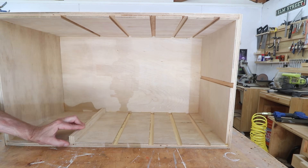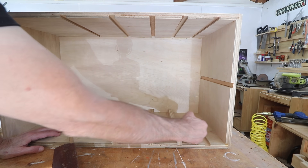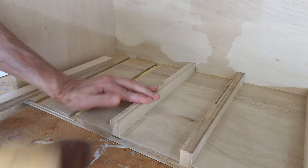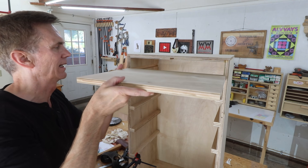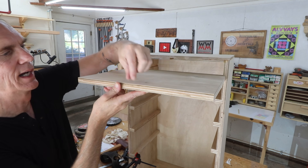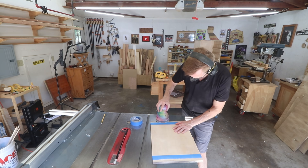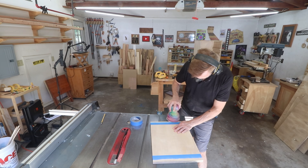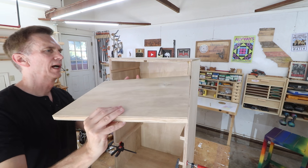It does require just a little bit of tapping. This top slot is going to get a full length shelf. I cut out this board to slide into the top slot, but before I glue it in I need to cut a groove along the center to match up with the upper groove. Even though I ran tests and got a good fit, this board fits a little tight into those grooves, so I'll just sand a little bit off of the underside.